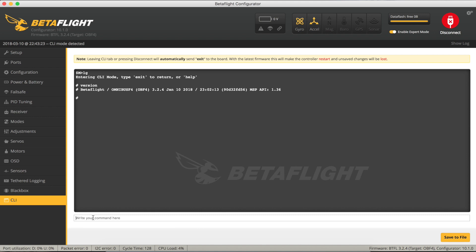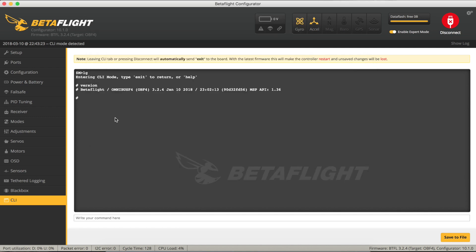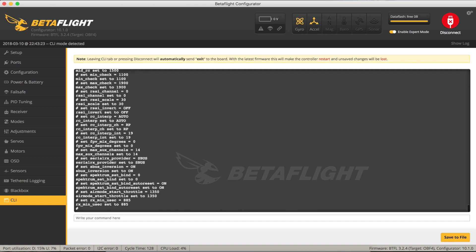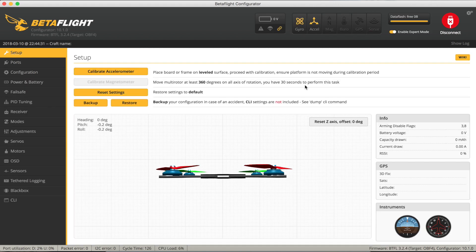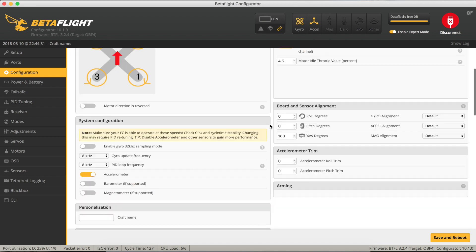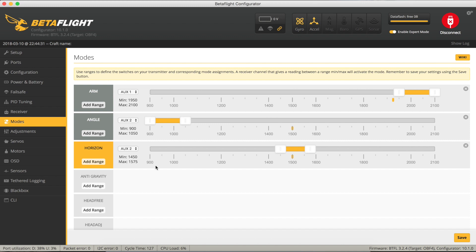But we're not quite there yet, because we need to restore from the command line dump we did previously. Go to that file, select all, copy, go back to the command line interface, paste into the text box, and hit enter. It's restoring all the configuration we had. Don't forget to hit save, then reconnect. We've got telemetry setup, configuration is correct, DSHOT 600, PID loop frequencies - checking the PIDs, those are my PIDs. Modes are set up too. Let's just go into the command line interface, type 'version' as we did before - nothing's changed and I know I'm back with the same version of Betaflight.